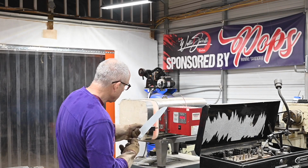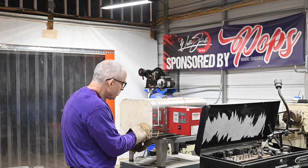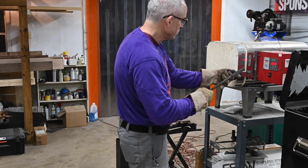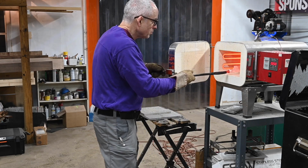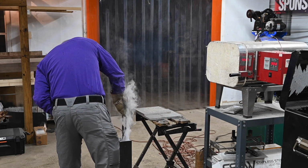Now it's into the heat treating oven. Pop's recipe is a 10-minute soak at 1520 degrees, then quench in a fast oil like Parks 50. This is theoretically a water quenching steel, so you really don't want to quench it in just any old random bucket of transmission fluid or lizard snot or whatever. After that, 2 rounds of tempering at 390 degrees Fahrenheit.